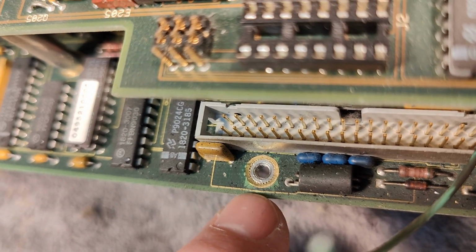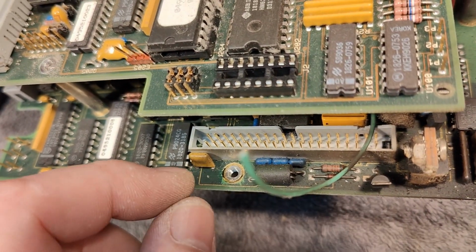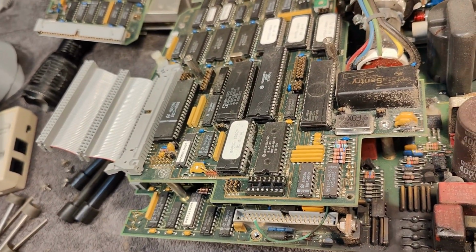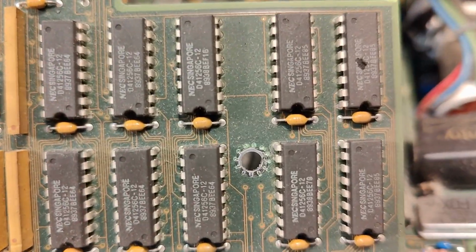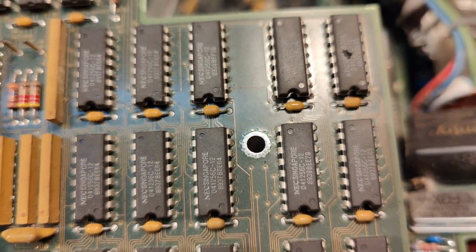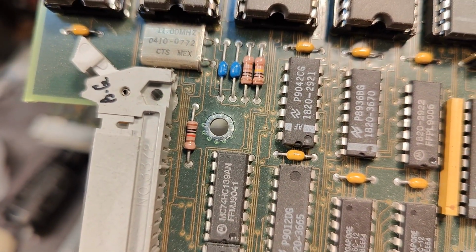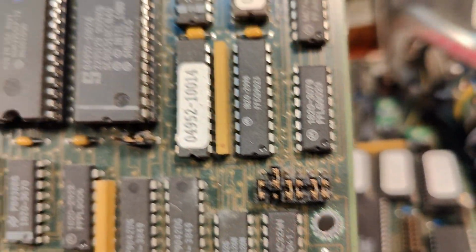See that track and the distance to that? This is the ground mounting. So depending on the ground, I mean, how you screw this in, you can damage this track. And this is the same problem on all the boards. This is the top board, and the screws, they're with integrated locking. And look at the distance to that IC here. It's half a millimeter. So depending on the alignment of the holes and the screws, and the distance to here, it's sort of fair distance. But I don't like any of that.